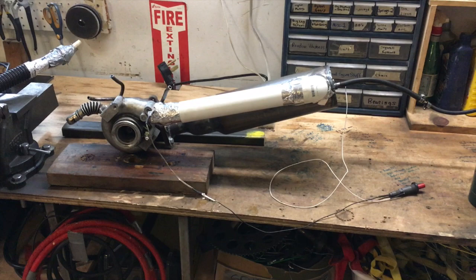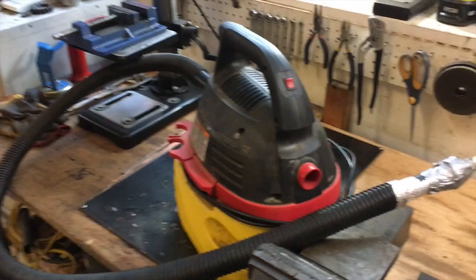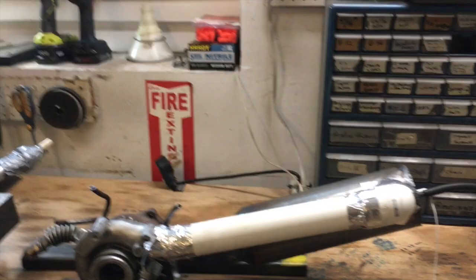We have some footage of this and we will show it to you shortly. Before that, I have a few notes. We used the rear end of a shop vac to spin the compressor up, with a funnel to speed the air up to the requisite point. In the video you will see, at the very last minute, we take the air hose away from the compressor. We know that the turbine is running in a self-sustaining manner when it does not slow down — when in fact it speeds up under its own power, consuming gas.